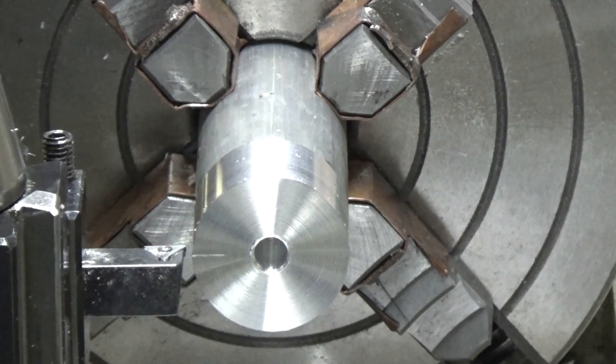This M baffle is going to be possibly one inch long, inch and a half in diameter — it's just going to be a sample. So I'm going to turn down about a quarter of an inch and start to cone part of it.